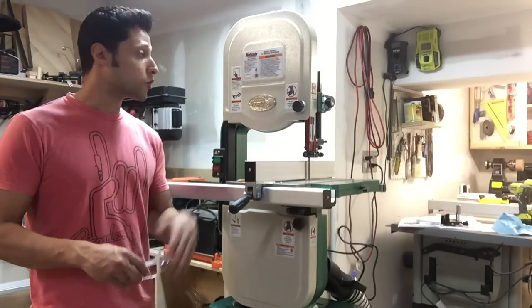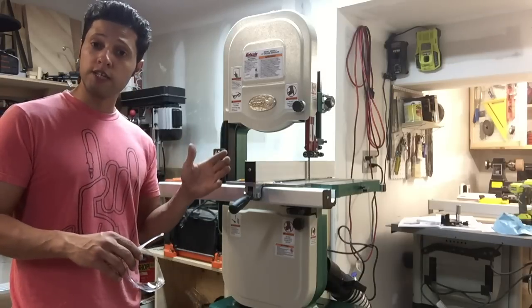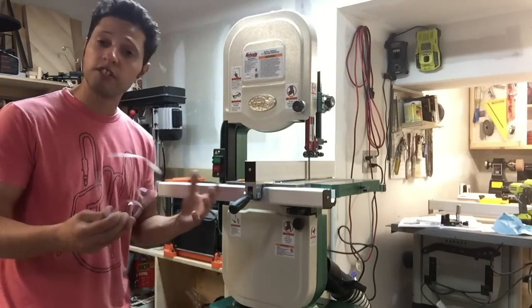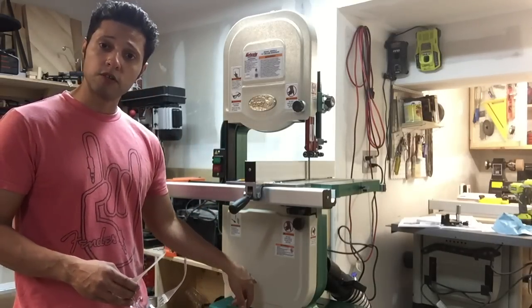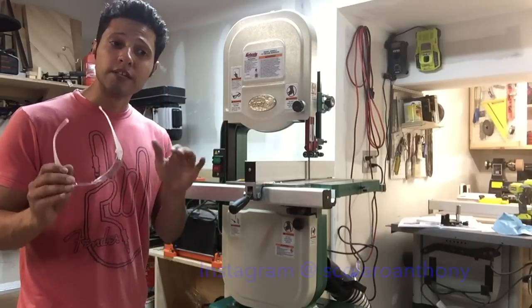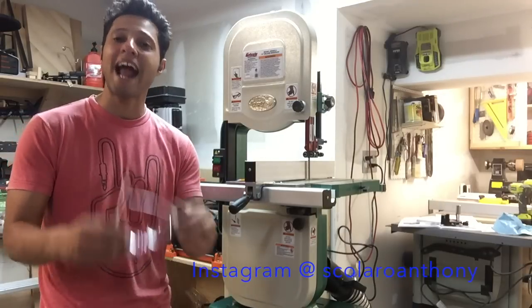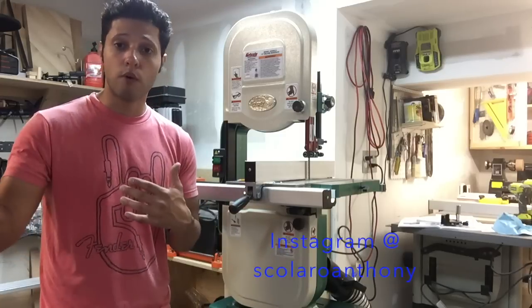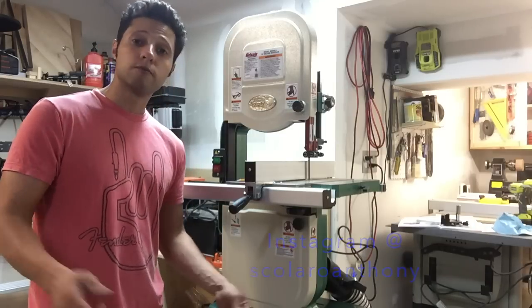So that's it for a quick review. This is the G0555LX Grizzly 14-inch bandsaw — resaw capabilities, curve cuts, anything you need: salad bowls, big logs for turning blanks. This thing does it all. It's got great power; I believe it's one horsepower. Runs well on 110. It has two speeds — you can adjust the tension on the motor and switch the belt on the pulleys. I just want to tell you there's absolutely nothing wrong with my other bandsaw, the WEN 10-inch — it's just that very quickly I outgrew it for the amount of woodworking I'm doing. I had the opportunity to upgrade to this, so the other saw is gone. Whoever got that saw — I'm not going to mention any names, Tommy — you got a great saw. So that's it for this quick review, and I'll see you guys next time.